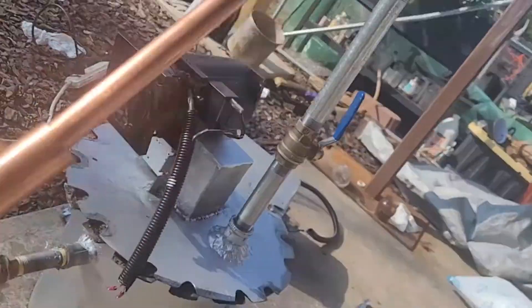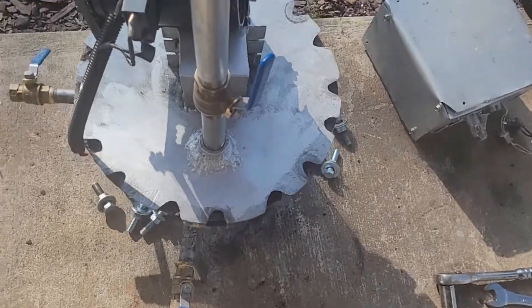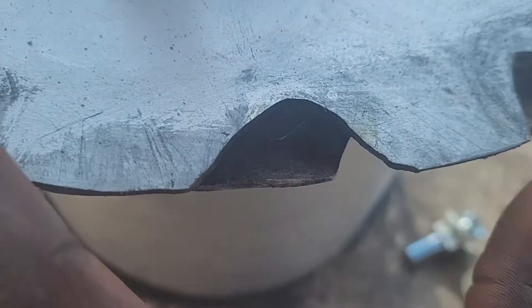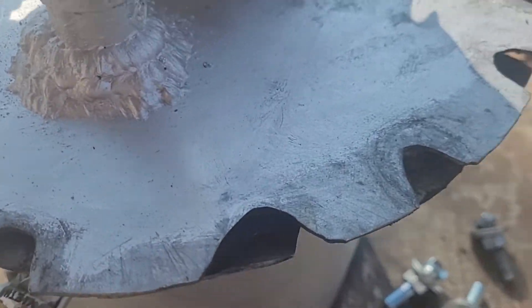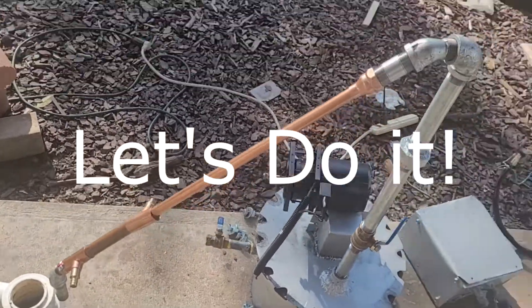Right now I don't have an activated carbon and zeolite filter, but it could go right here. The last change I made was adding eight additional slots for the nuts and bolts, so the system now goes up to 16 nuts and bolts. The reason for that is there were really minor leaks — there used to be a bigger gap between where each nut goes, and that small gap was leaking, which is unacceptable. Another issue is that when I went to weld this it warped the plate, which is a problem for a different day. So now I'm going to braze and solder all this copper together.